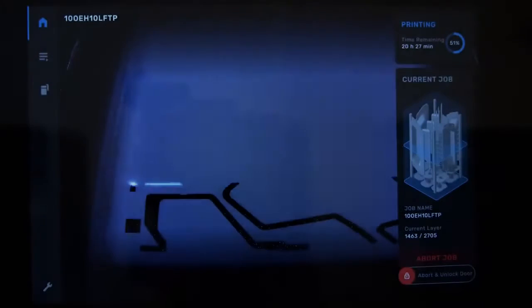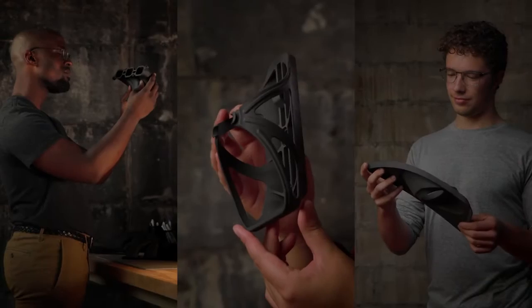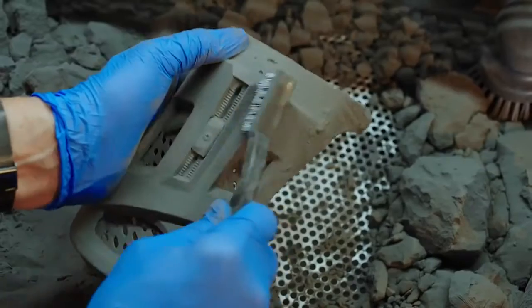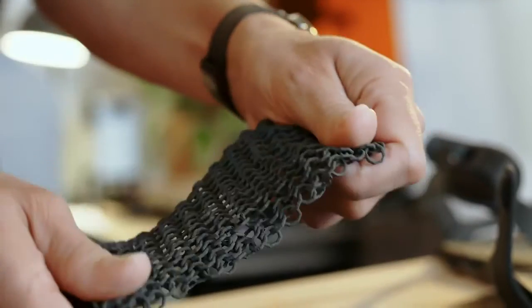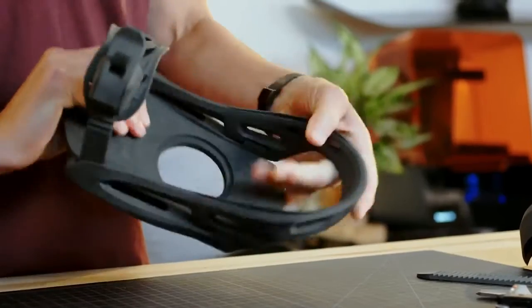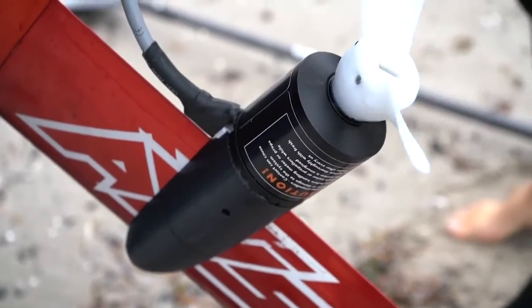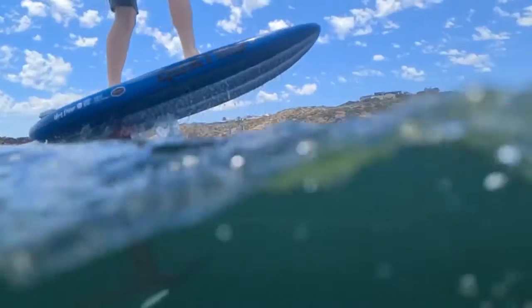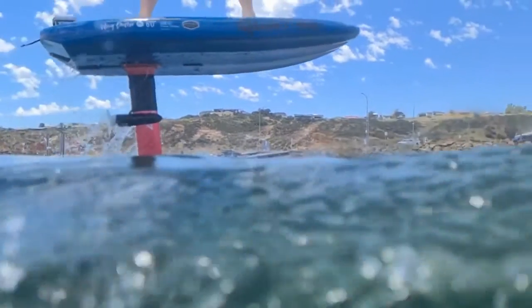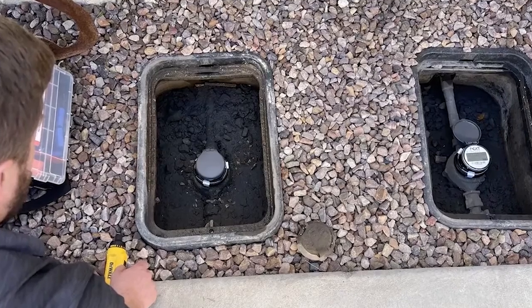SLS 3D printing materials offer excellent mechanical characteristics that resemble traditional injection molded parts. The most common SLS 3D printing material is nylon, a popular engineering thermoplastic that is lightweight, strong, and flexible, as well as stable against impact, chemicals, heat, UV light, water, and dirt. SLS nylon is a great substitute for common injection molded plastics, as it can be sintered in parts with superior snap fits and mechanical joints. It's ideal for functional applications requiring long-lasting plastic parts, where parts produced with other 3D printing processes would degrade and become brittle over time.